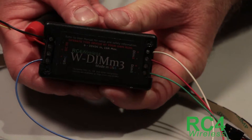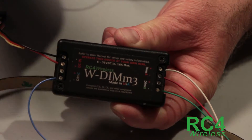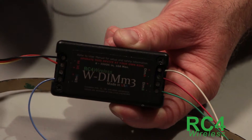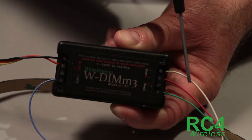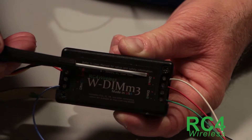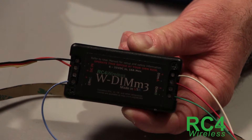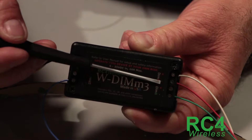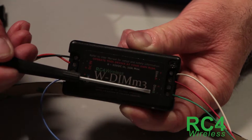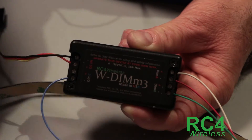Let's get those screws tightened and review exactly what's happening. Power comes in here — red is positive and black is negative, as DC power is supposed to be. The white wire is the positive common for the LEDs, connected to the positive terminal on dim A. It could be any of the positives since they're all the same. Then the red line goes to negative on the first dimmer, green to negative on the second, and blue to negative on the third. That's the complete setup.